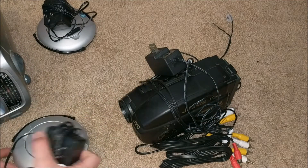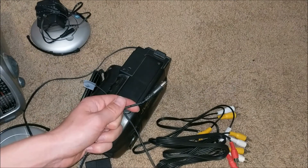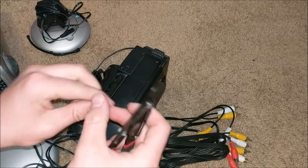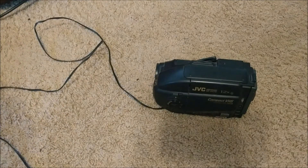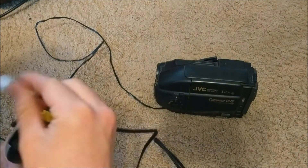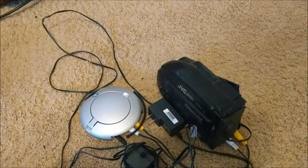After you have all your parts gathered, you can start setting up your camera. This camera has a battery pack that sticks in the back going up to two wires. You're going to have to connect these wires to a power supply, and to do this we're going to cut it and splice them on. We'll just take the cord, slice it off, split it, and remove the coating around the wires to get two bare wires, which we'll then attach to the two bare wires coming off the camera. Then take the transmitter, connect it to your video camera using RCA cables, plug in your power supply to the transmitter, and you're ready to bring it to wherever you're setting this up — this huge mess of cords and wires.